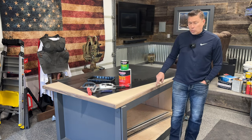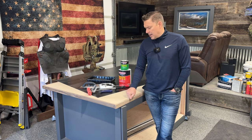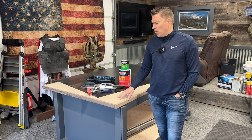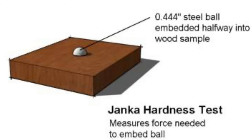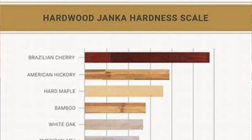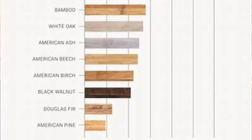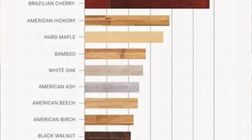The next thing is the hardwood. I actually did some slabbing a couple of years ago with a friend and got some black walnut. A lot of people talk about softwood versus hardwood, and hardwoods are measured in what's called a Janka rating — basically the amount of force required to embed a steel ball halfway into the wood. Black walnut has a Janka rating of 1,010 pounds. For comparison, pine ranges from about 300 to 600 pounds, while hardwoods like oak range from 1,200 to 1,350 pounds.